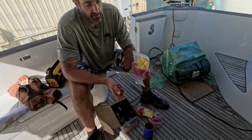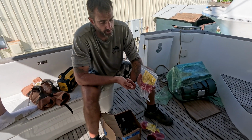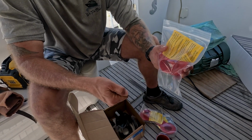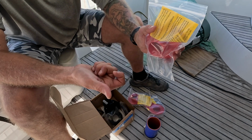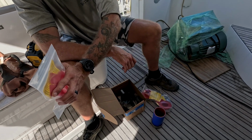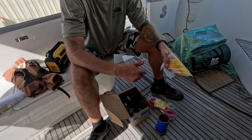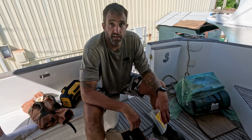It's kind of old-timey. You don't want to take too long, but you don't have to rush it either. You want to do it right. Pick that off. So you have this set up. You pick the old seal off. Water's going to start coming in because you no longer have a seal. You're going to cut it, take it off, throw some Dawn down, slide it right in there. That should seal right back up. Pull the red part off, put the cover back on, and then you've got another couple of years until you put the other one on.